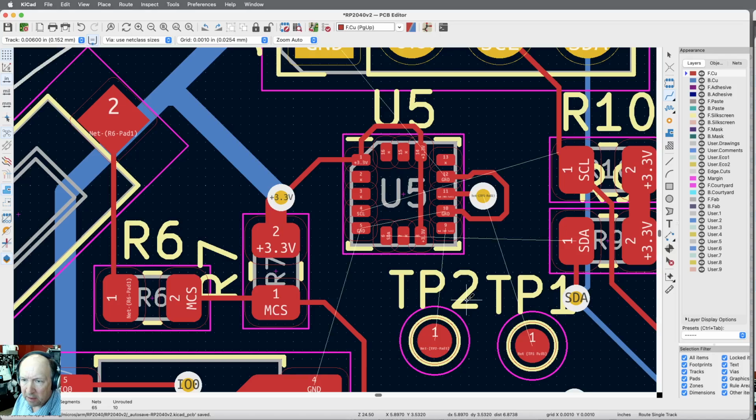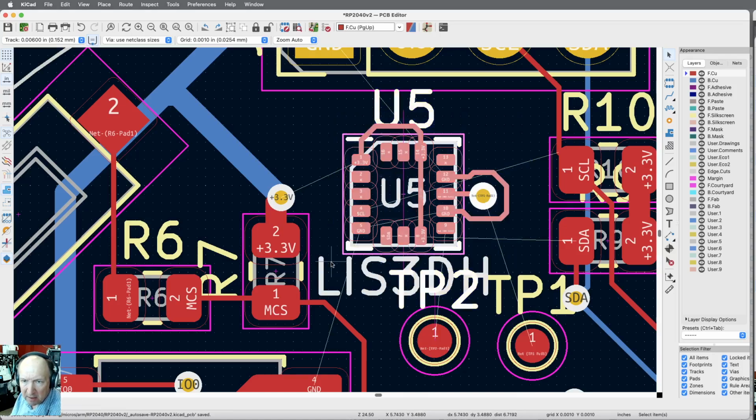Because the SCL and SDA are really in the wrong spot for that. Let me do that. I think that'll make more sense. Let me just delete these two traces. And this is pretty well isolated. I'm going to try to flip it with all the parts. So I hit a bunch of escape keys. Then I'm going to take this and just swipe it like this.